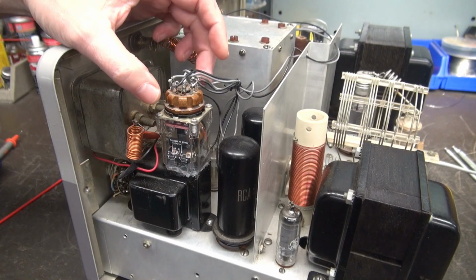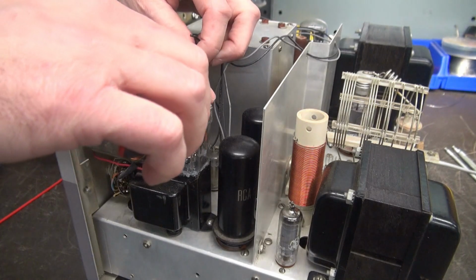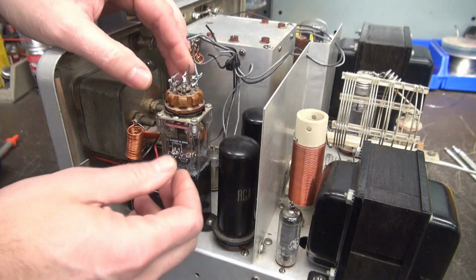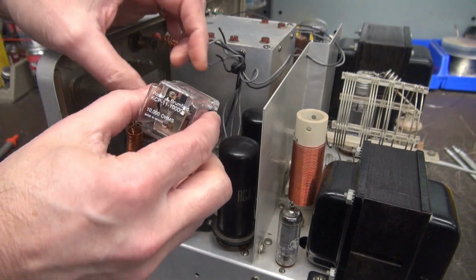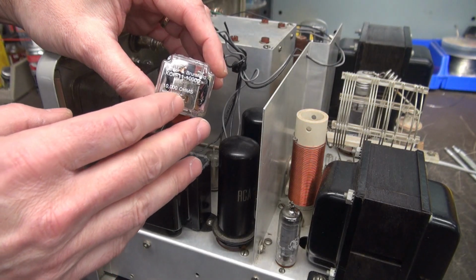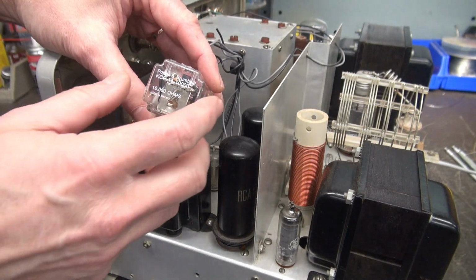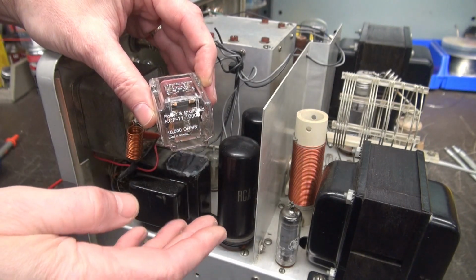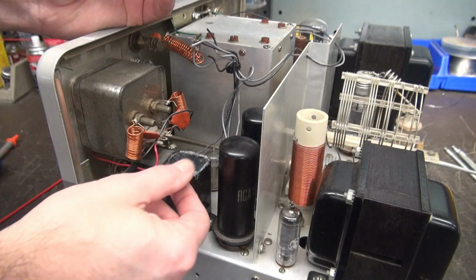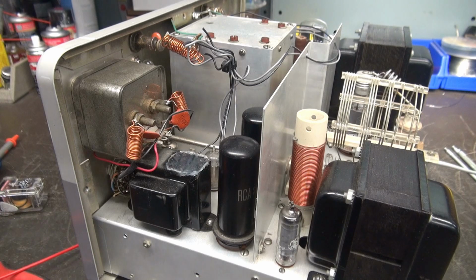Alright, so my usual, I do not bother to trace and document this stuff. I just remove it. Then I go back to the manual, find how it was to begin with, and put it back. But what I'm real interested in is, what is the coil voltage on this relay? It's a 10,000 ohm relay. Okay, so that's what Johnson originally used when they had the vertical mount one over by the keying platform. So this is probably a DC relay, I'm guessing, since we had 170 volts DC. And that's what you would normally see. But that is dangerous. So we're going to go over to the other system and remove the hazard. So it looks like I got a little bit of cleanup here to do. Pull these wires out, and we'll get her done.